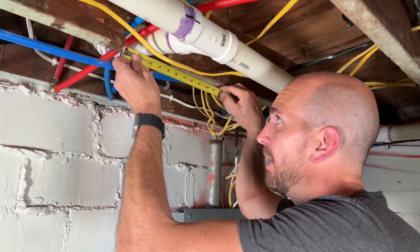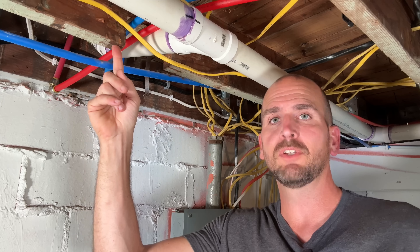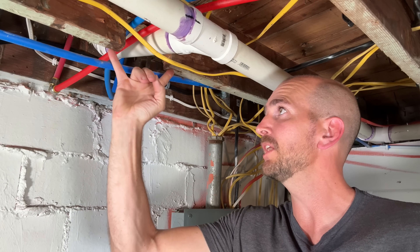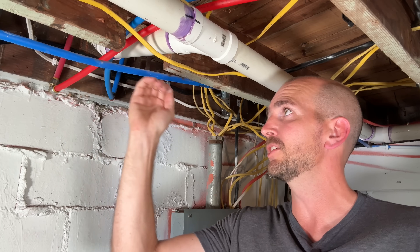The notch is about five inches by give or take three inches, and what that does is it takes away the ability of this floor joist to actually hold tension at the bottom. That's what was called out in the homeowner's inspection — the structure of this joist is no longer valid.